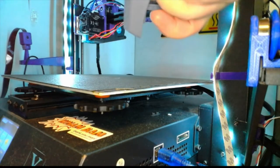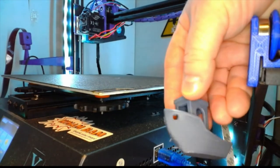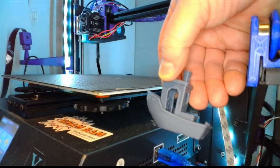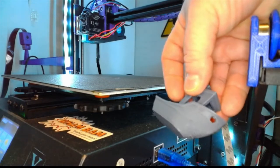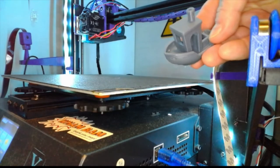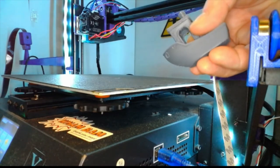Underneath is okay. What do we got here? Yeah, so the bow's still a bit dodgy, so I'm probably still printing a little bit fast for PETG to overhang that much. If I was to print this on my mini, it's got a smaller than average nozzle, so it takes a bit longer to print. But you get a much cleaner, nicer little print. So otherwise, dimensionally, this doesn't look too bad. You'd measure it with your calipers just to confirm.